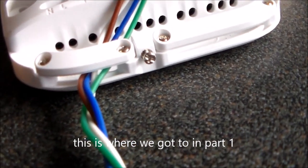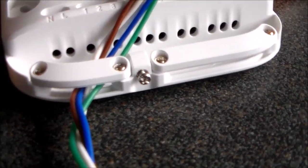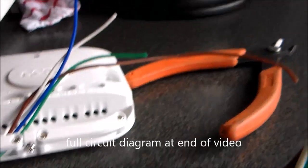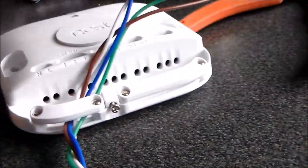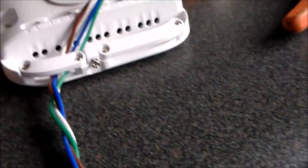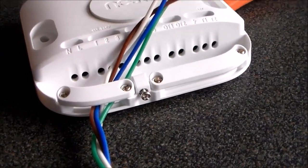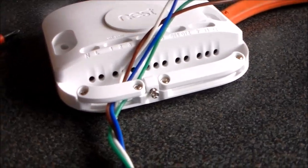I'm using unsleeved wires because I wanted four wires and the cord grip doesn't screw up tight enough to trap single wires. My intention is for this to be all wired within the confines of the boiler housing, not an exposed flex you might need to consider. For testing purposes only I'll be using this, but for future installation it will either have to be three core wire or a multi-core four core wire with overall insulation so you can get it clamped up in the cord grip screws.